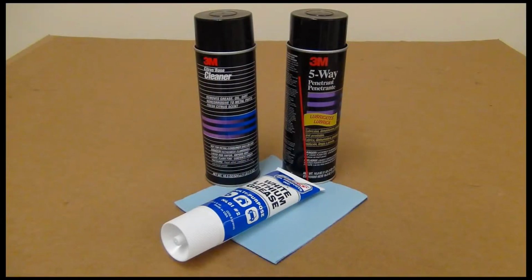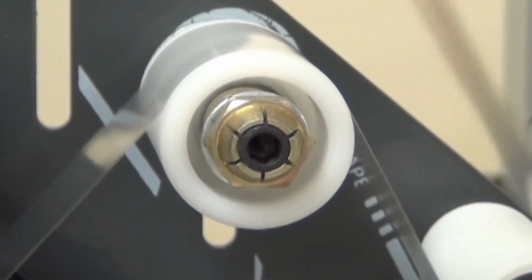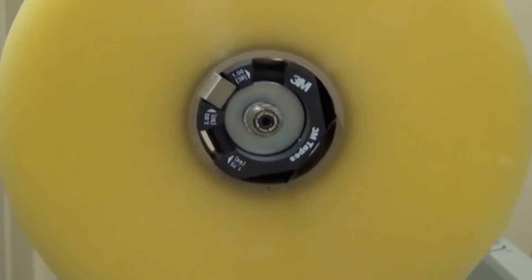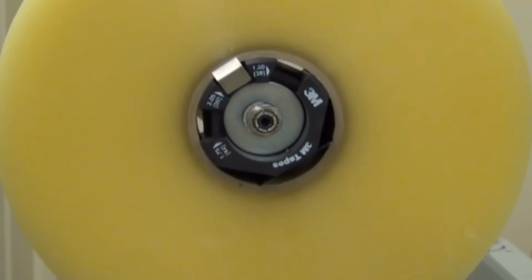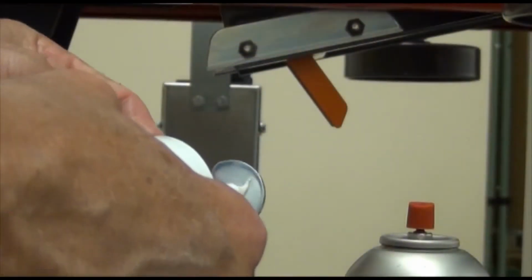A general rule of thumb is that any pivoting or rotating part should be oiled, and any parts that slide and spring ends should be greased. Use caution when lubricating the constant tension roller and the tape drum shafts. Make sure that no lubricant gets between the base of the roller, drum, and side frame of the taping head. The lubricant will reduce the tension capability of the component.